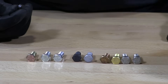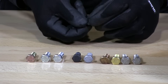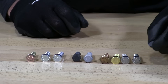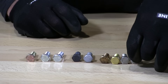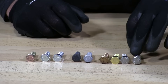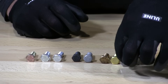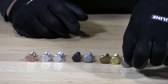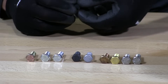I just wanted to give these a magnet test so you can see some are magnetized, others are not. This is a 316 stainless and in this situation there's no pull from the magnet. This is an 18-8 which has very little pull — not much, but there is some partial magnetic field to that.